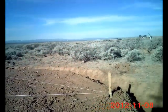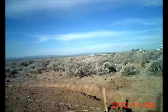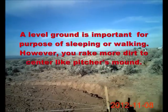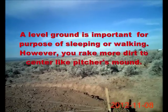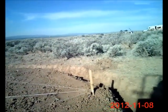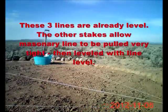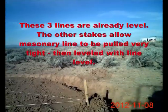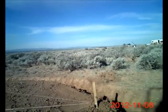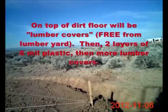This is done typically also in home construction, general repairs, pouring a slab, or making a backyard patio. That's masonry line stretched from one central point — the highest point — out to three different stakes. Again, you could use five stakes. I've spent about a day and a half on this project. The work is essentially already done here, so I'm showing you what the finished floor looks like.